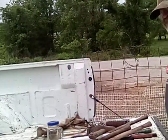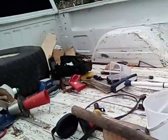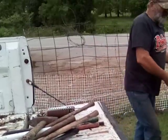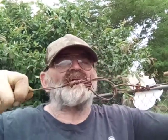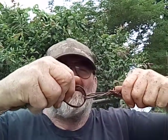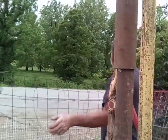If I can find my wire, I have. You'll see, when people fasten their wire together, they'll do something of this nature. Loop it, this, that. When you go to stretching, if you really put stretch on it, this is going to flatten out. It might not flatten out when you first stretch it, but eventually over time, it's going to flatten out. So what I like to do...